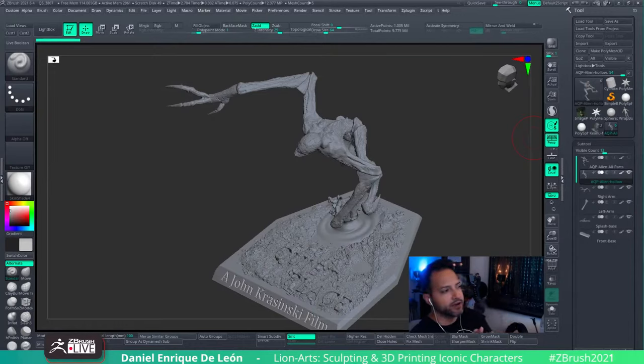And that was also a more aggressive printing process, where something might become a little too fused to the base of the tank, and that could cause ripping and tearing or breakage. And so the lower force, which is in the new one, the Form 3, you have almost a natural peeling process, rather than having this pulling up to peel off. It pulls at a slight angle, I think. There's a slight angle to everything, so that's a sort of diagonal pull in the original and the Form 2.